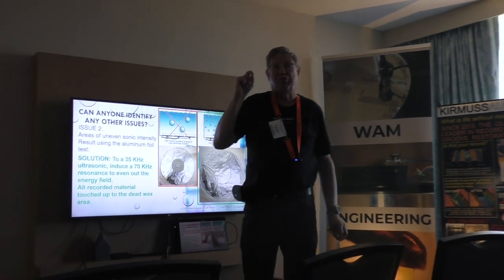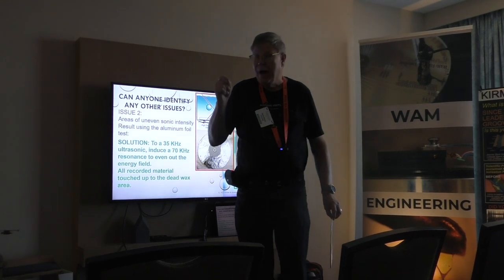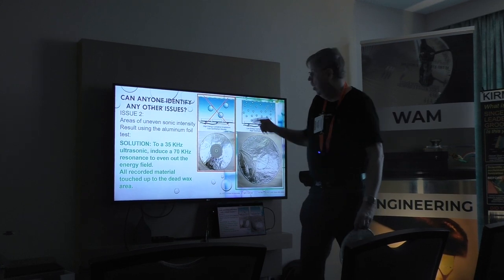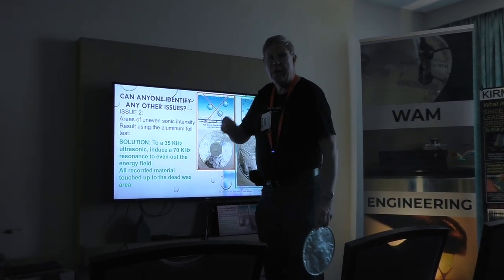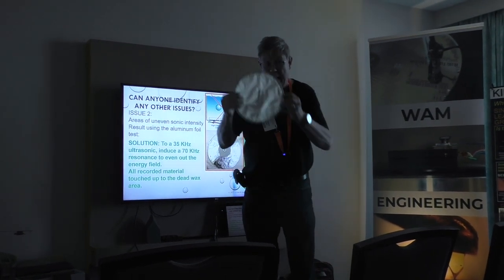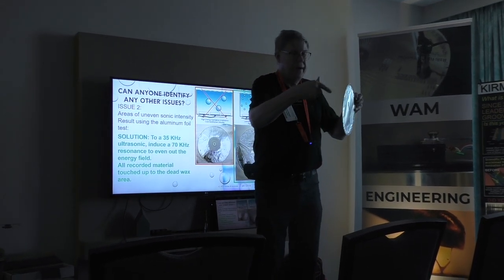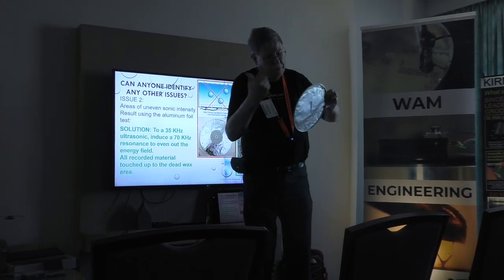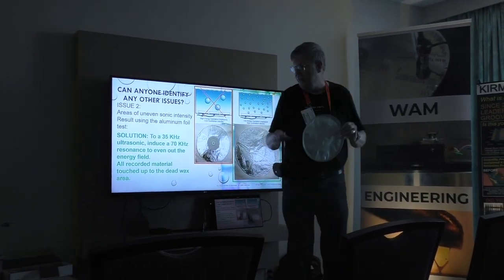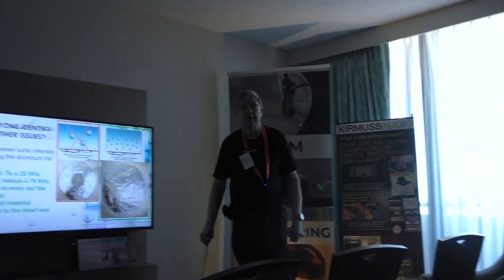There's the law of surface area, where ultrasonics have loading issues. I cannot overfill a 6-liter ultrasonic bath with more than X amount, and it goes by square inches of area that you need to cover. In a record, you can calculate this from the radius squared, multiplied by pi. So you calculate the surface area, and using a 35 kilohertz ultrasonic, I can only put 4 LP-size records inside.